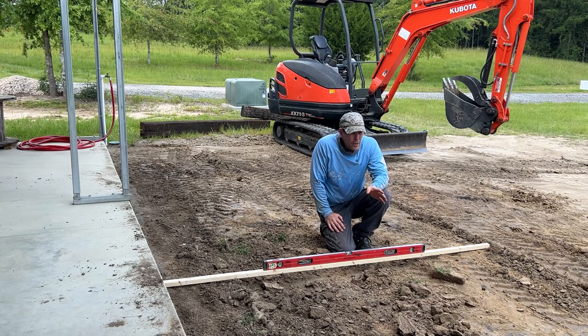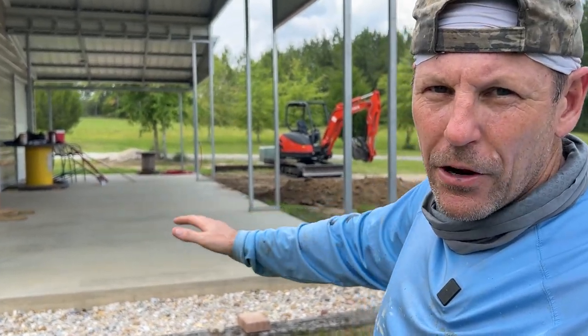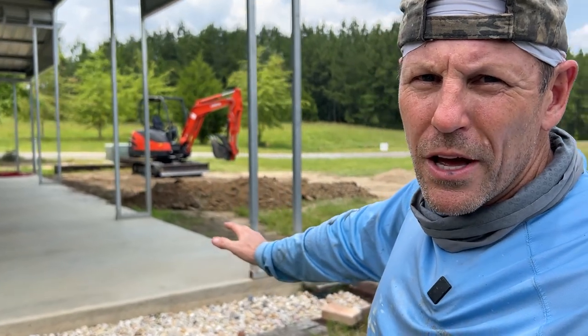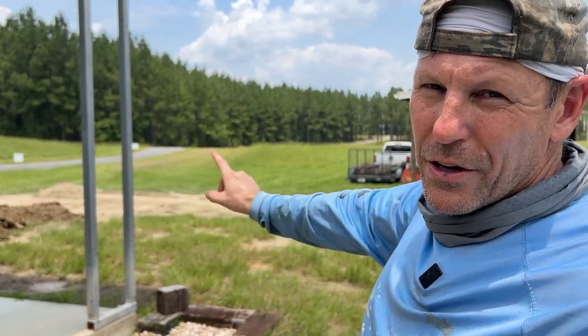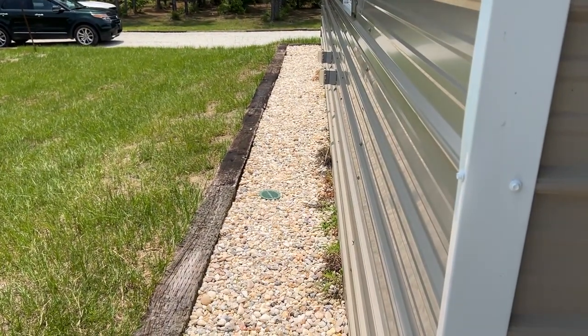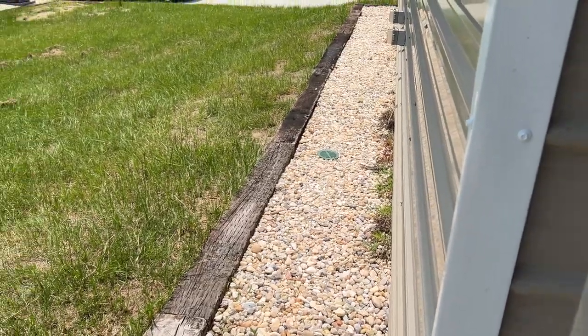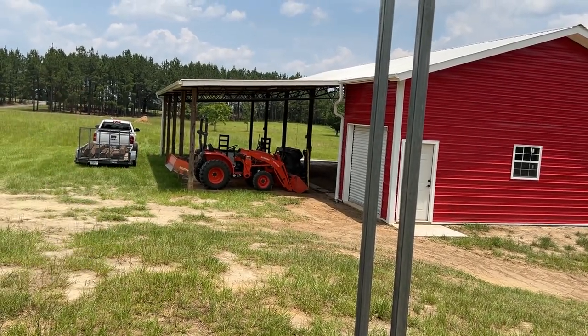It's easy enough to fix - I have plenty of good crumbly clay here. I'll put it in and pack it in with the excavator. One thing we did when we poured the concrete for the mega shed is we sloped it two inches from the sheet metal for the whole fifteen-foot length of this porch. So we already got a good slope here - any water that goes on this porch should go onto that gravel bed and then down the hill. We slope from that way to that way, and also from here to there, and all that water eventually ends up in an underground water system. We also collect water along the edge of the mega shed - you can see the basin right there - and it goes underground to a basin by my truck and all the way down to the pond.